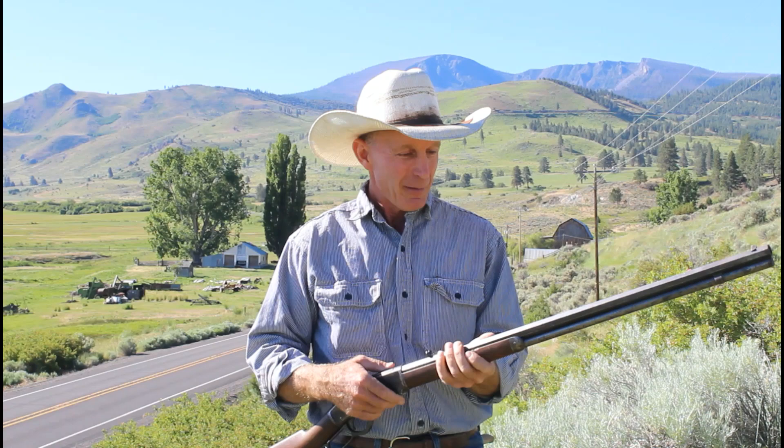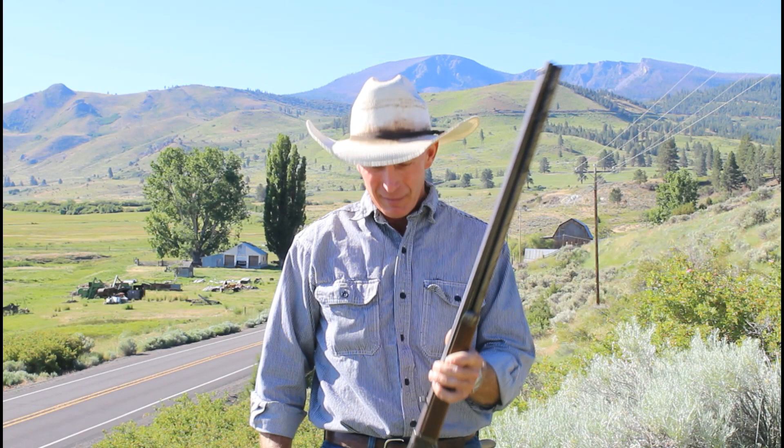The action cycled — I haven't a clue how — because when we took the side plates off, it was just full of gunk and corrosion. The brass carrier lifter was just green. I tried to put a bore light through it and couldn't see a hint of light through the other end. This thing was full from one end to the other of a bug's nest — just desiccated bugs, a thousand of them probably. The bolt and firing pin were rusted into the bolt solid.